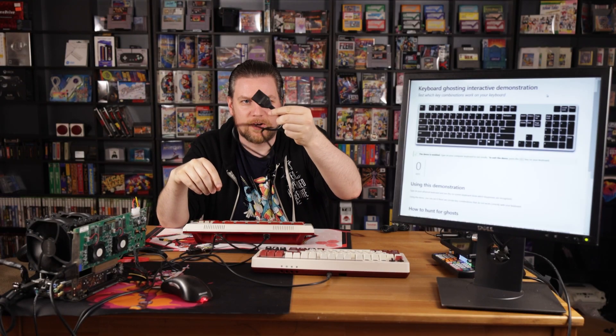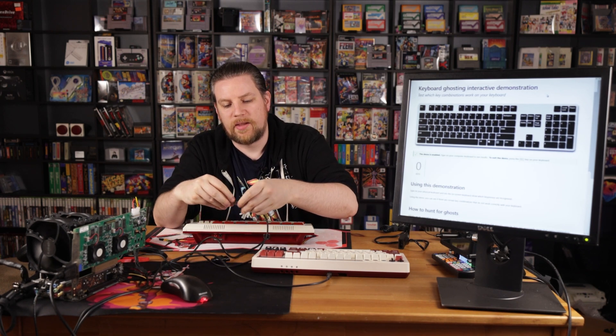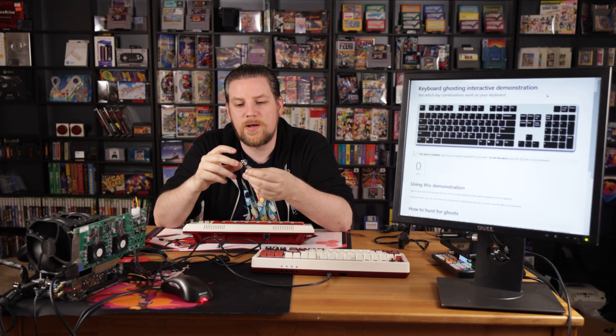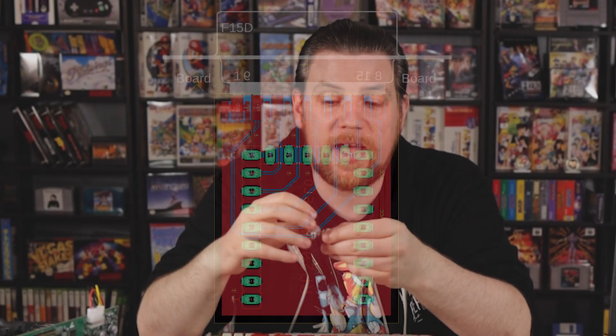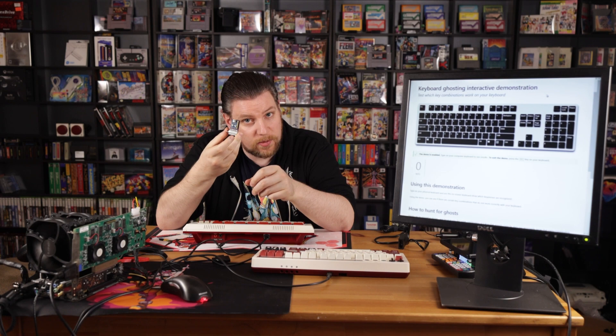Wait — this is sitting here and it's not plugged in. How is that working? What I did afterwards is I took that exact design — literally just wires from the pins going directly into specific headers on the WaveShare board — and quickly in CAD I drew up the schematics for this tiny little board for the WaveShare to plug into. It has headers on the edge for the socket to slide onto and get soldered in. Upload the firmware and we have ourselves a USB keyboard adapter.